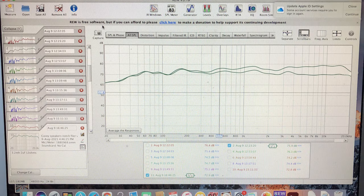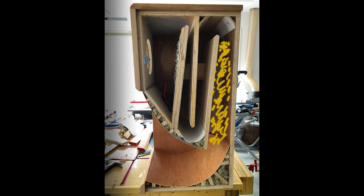The frequency response is fairly flat, but we decided to roll off a little with a notch filter in the section between 400 Hz and 14k Hz, to give it a flatter and smoother response across the line. The final result is pretty good — we've got fairly solid bass from the 40s all the way to 18k Hz, which is really impressive. I only had to use some acoustic foam in one small portion of the folded horn — on half of one side of the last portion. Having a divider in between, one half has the acoustic foam and the other doesn't, and that helped balance the acoustic pressures and the frequency response.